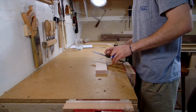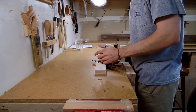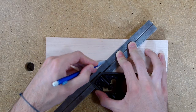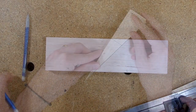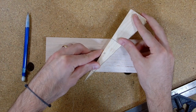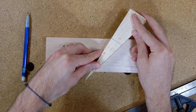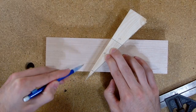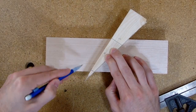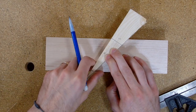As you saw, I started off with a piece of straight grain maple that is about 10 inches long, 4 inches wide, and about an inch thick. I measured 6 inches from the heel of the plane and laid out a 40 degree line. This will be the bed angle of the plane. Next, using a 1 to 4.5 inch wedge, I drew another line referenced off the bed angle that will account for the wedge that will hold the chisel in place.